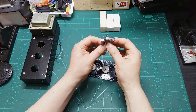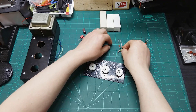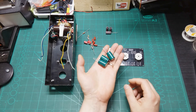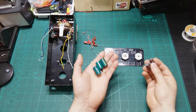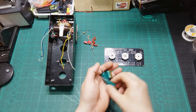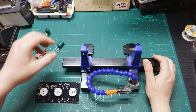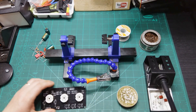You can see some nice Elna capacitors, WIMA capacitors for the output, two-watt resistors, and other resistors to be soldered on the board. Before we start soldering, I want to mention I'm going to use Nichicon 100 microfarad 250-volt capacitors instead of the Elna 10 microfarad 450-volt ones, because I want to smooth the DC voltage really well. I'm setting up the PCB board holder, soldering iron with a fine tip, soldering wire, and some flux.